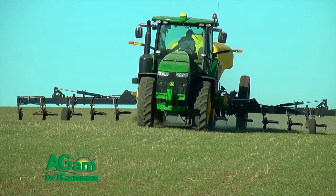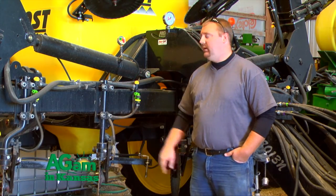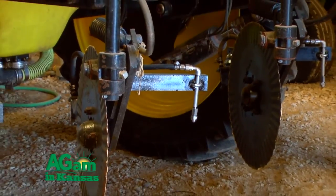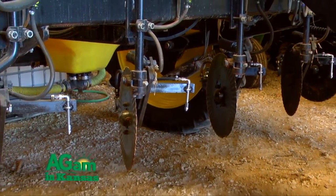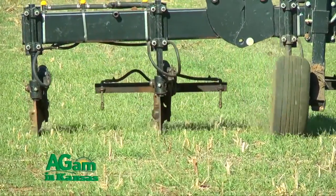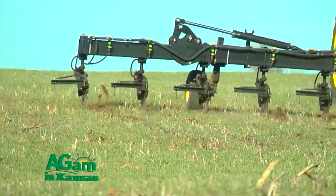So I came up with an idea to build this little bracket design right here, and tee off the feed lines for the injectors and put it on 15-inch centers. That way we have one coulter in the ground and one shooting above the ground, so we can possibly get a little different nitrogen use at different times of the year.